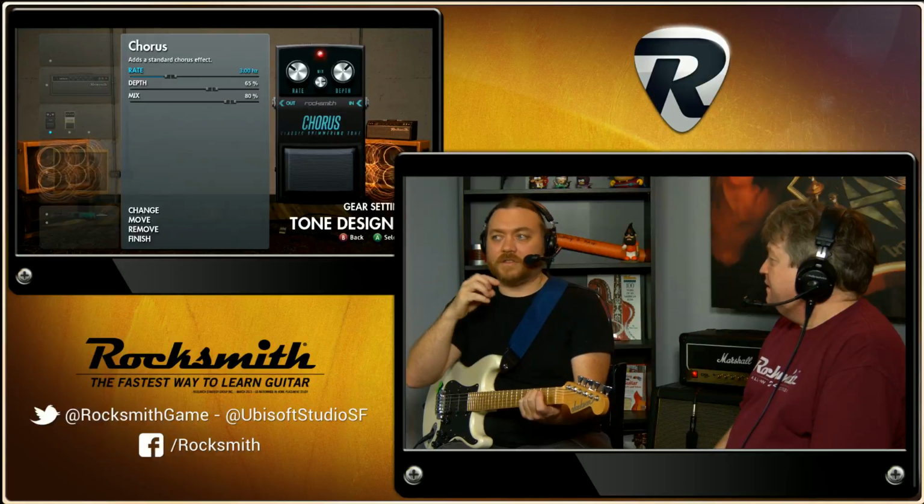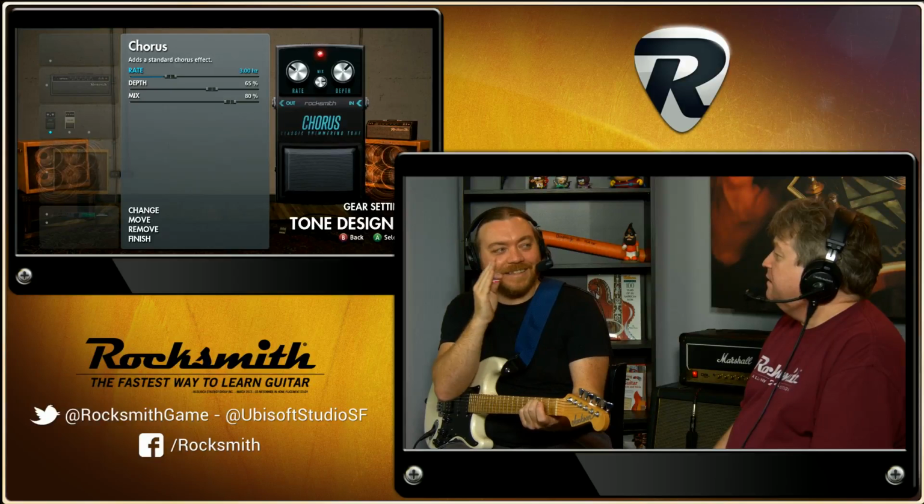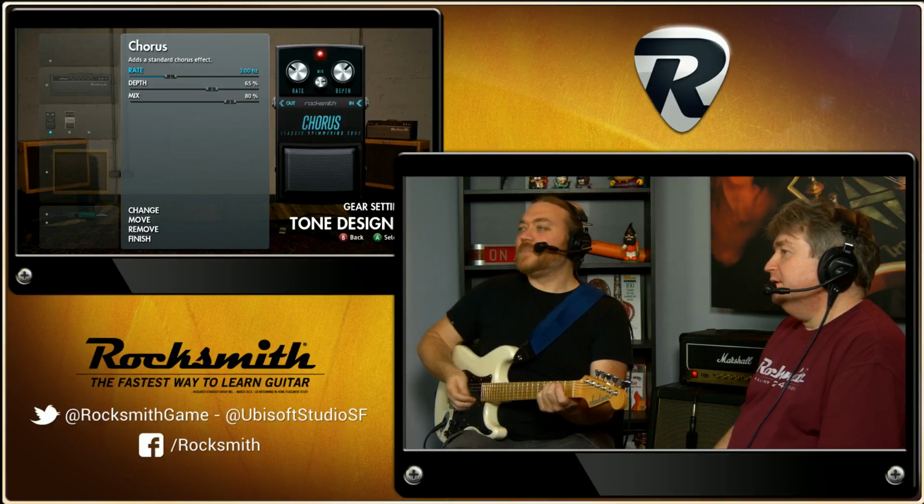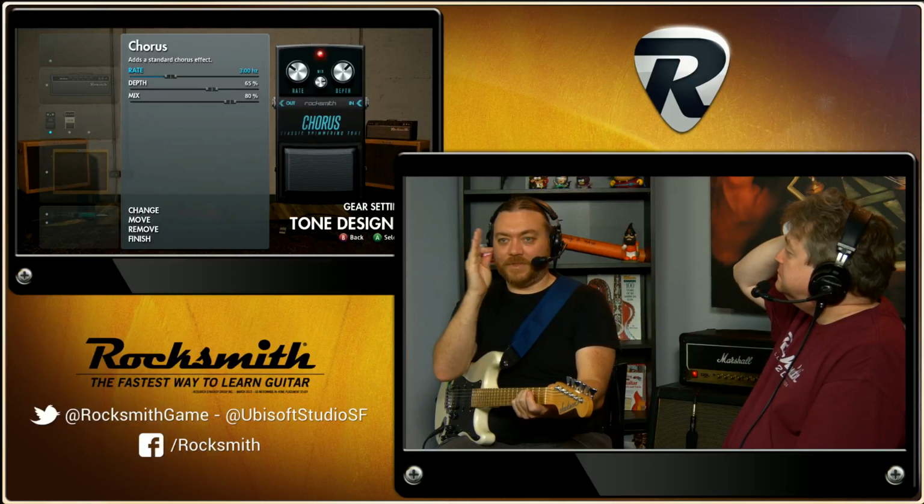That's what creates the chorus. The delay is actually changing its length slightly, which causes the pitch to go up and down, just like we were messing with our delay pedal here. Sure. I was touching the delay time and it was going, weep, weep, weep. This is the much more subtle version of that. Right. So really all this is just a very short delay pedal. The delay time is moving around. It's going a little lower, a little faster, a little slower.